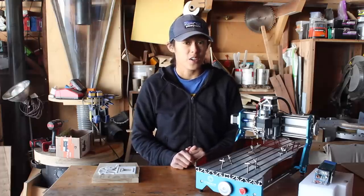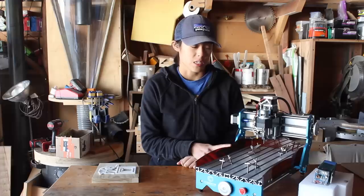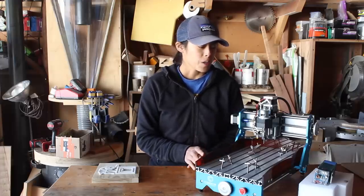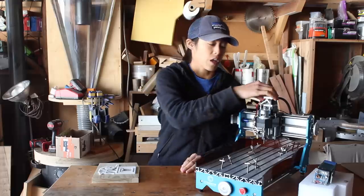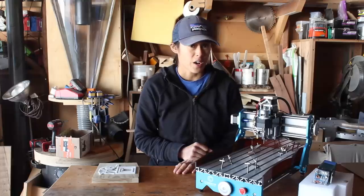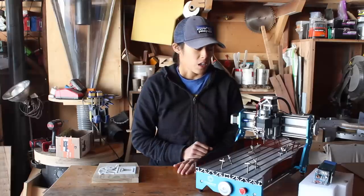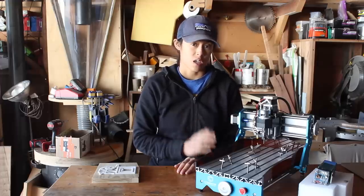For the remainder of the video, I'm going to summarize my thoughts on this Comgrow Robo CNC. Right out of the box it was really easy to assemble and compared to other desktop CNC mills, I think this is a pretty rigid construction. That being said, I think the spindle leaves a lot to be desired in terms of stiffness, RPM, torque, and just overall noise. So I think there are real limitations to what this machine is capable of.